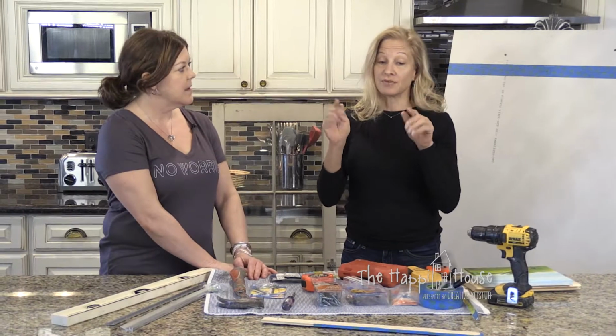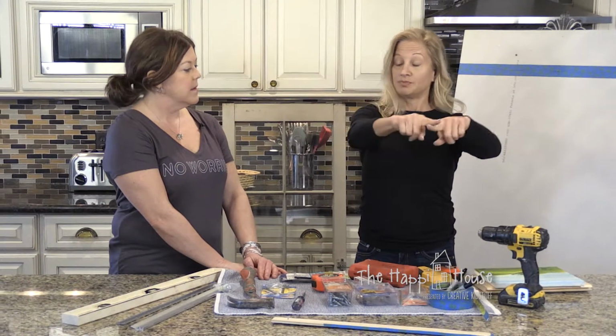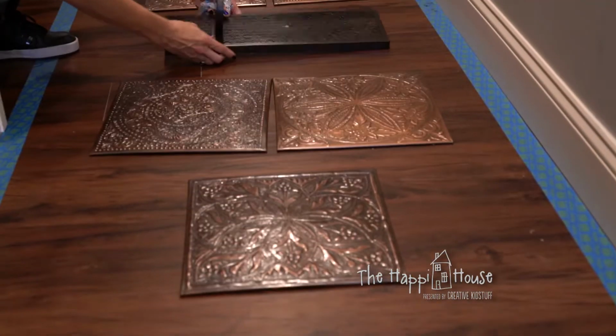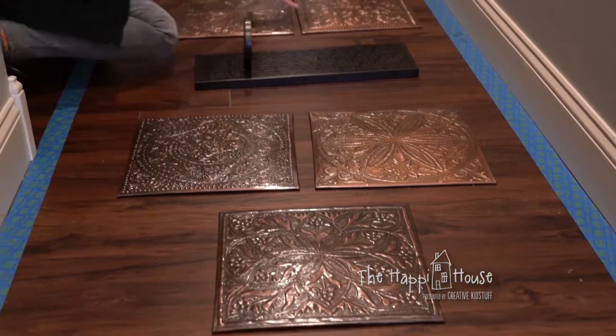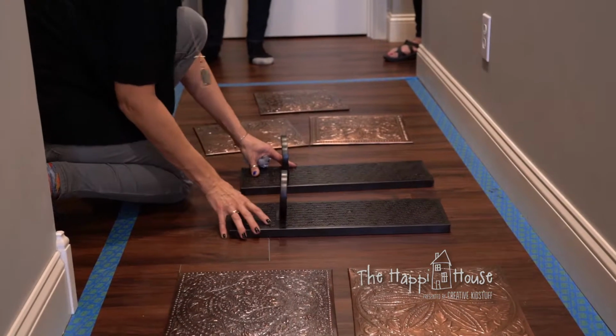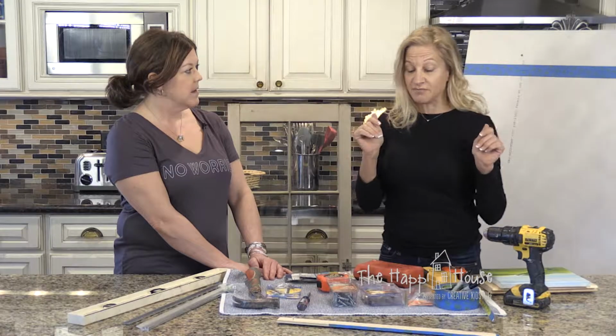If you want more accuracy in your hanging, such as 6 different items, the first thing I would do is measure your wall. I would put tape out on the floor in the dimensions of your wall, and I would play with it. Through trial and error, look and see what you find appealing. Then once you know your layout, find something uniform, like the width of a paint stick, to put in between each picture, so you don't have to sit there and use a tape measure.